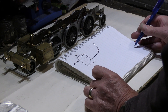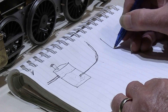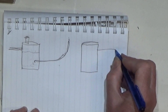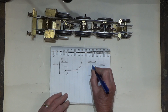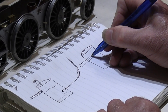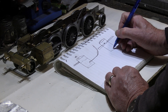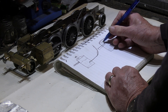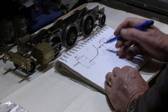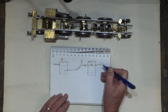On this locomotive you've not really got the room to fit something like that in the cab, so the next approach is what you call a displacement lubricator - very similar in principle. You have a reservoir with a steam pipe coming in that goes through and the pipe comes out the other side. Inside there is a tiny little hole. As steam comes through it condenses, and the water and saturated steam oil find their way out through that little hole and along into the cylinders. That's what we call a displacement lubricator.